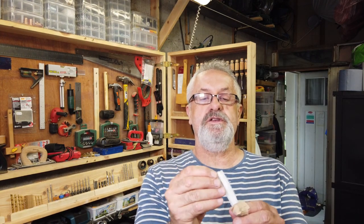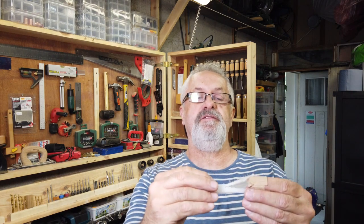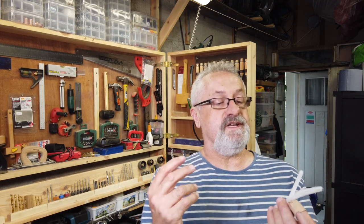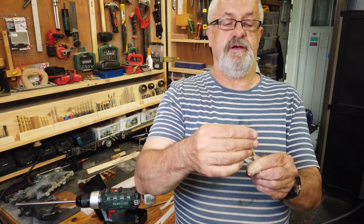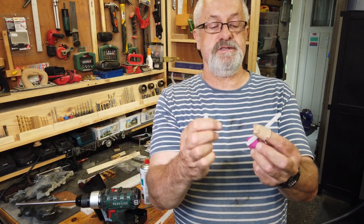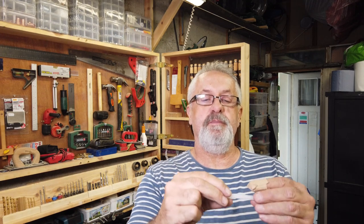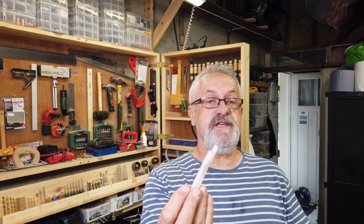After the cutting, this is what it looks like. All you need to do now is give it a bit of a hand grip on that side, finish it off, do the sanding, cut it to length, and then that's one done. You use exactly the same method for the other one — you need two thicknesses. One is for your brass tube, which is a fairly tight fit, and the other size is the brass tube size, maybe a bit smaller to allow for the glue — that glue stick is for your blank. Once you've cut them to length, sanded them and put a bit of a finger grip on them, they're ready for use. Let's put it to the test and see how it glues.